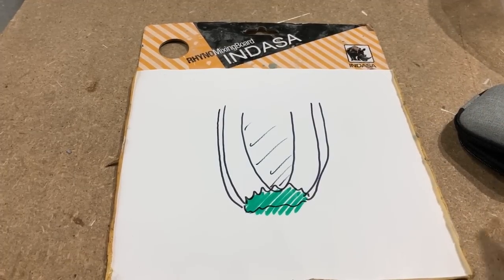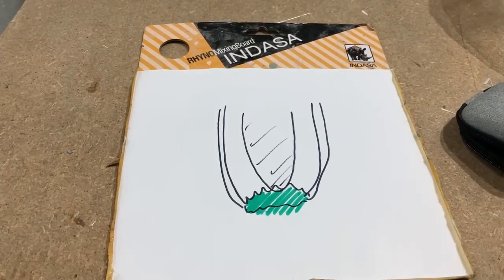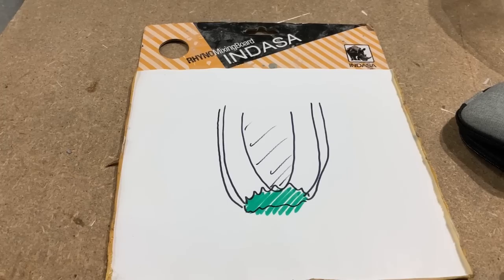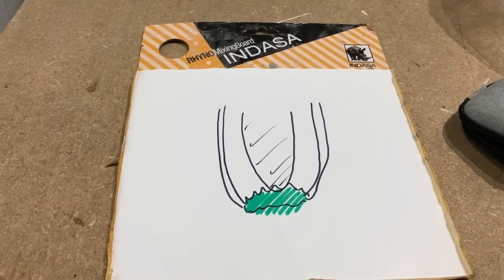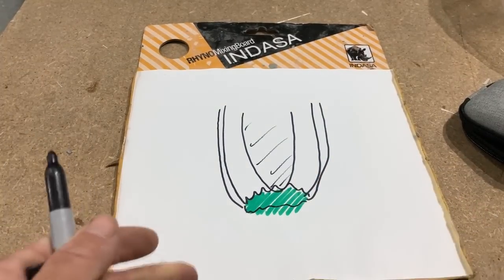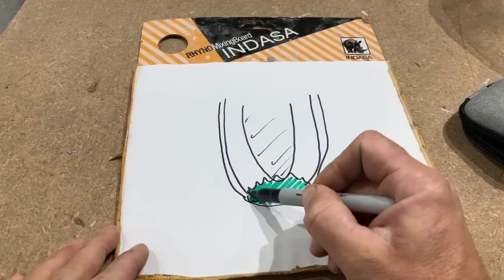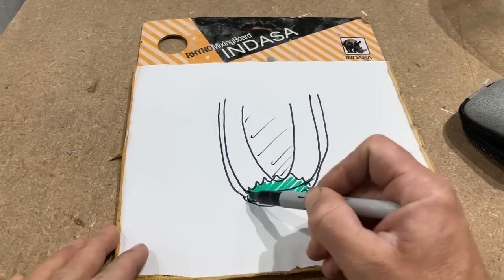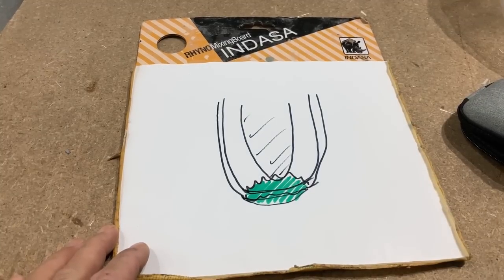I mean, I can thicken it up and it will kind of stick and roughly stay where I want it to go, but I'm either going to put some kind of masking tape or possibly just use some peel ply and use the peel ply to help hold it in shape. Let that go off, and then once that's all done, I will lay up some glass over the top to bring it back to how it should be with a new skin on the keel, both forward and aft.